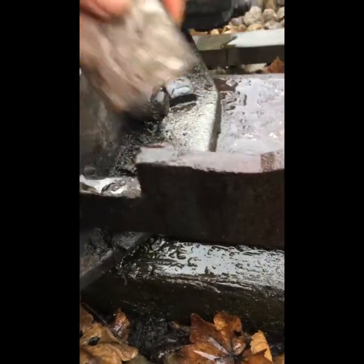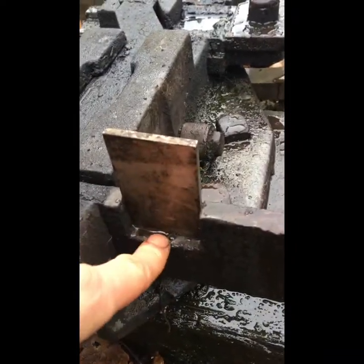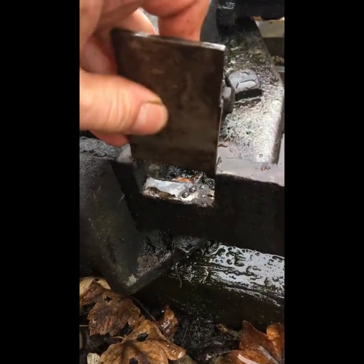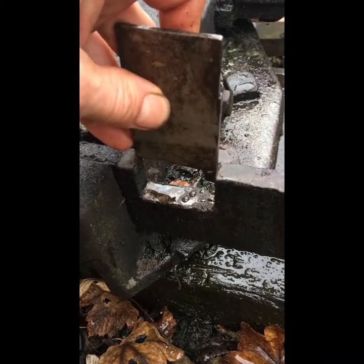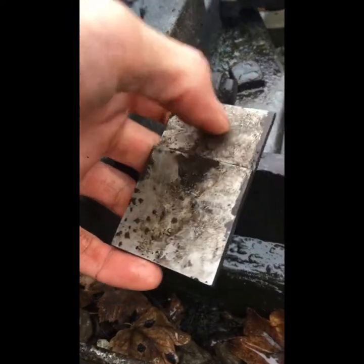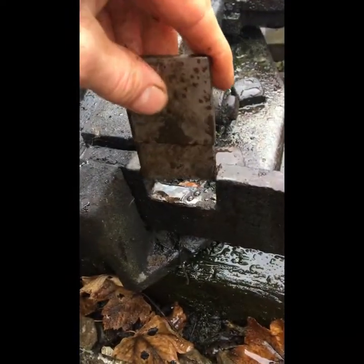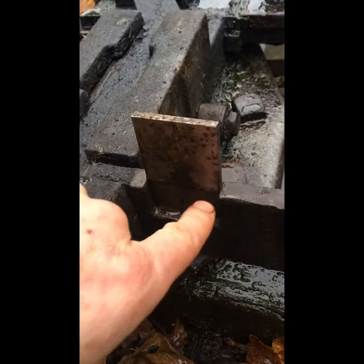This is your clearance. The small end — the 3.5mm end — should easily go through. The 5mm end should not go in. If you can get your 5mm end in, the rod is worn — either through natural process, trains, wear and tear. Then you need to put a new FPL rod in, because that's your go/no-go. That is both your depth down and your width across.